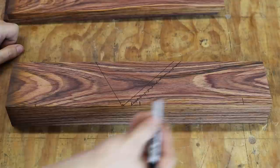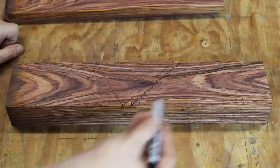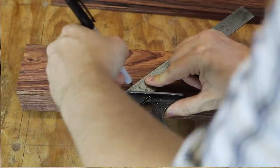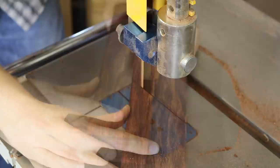I found rough center here, and then I went out six inches on either side. I made a mistake and just didn't mark it right, but we want to be in five inches from the front — 45 degrees at the five, and then 62 degrees just before it. With those lines marked out for our 45 and 62 degree cuts, I head over to the band saw.